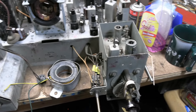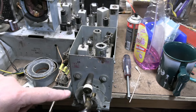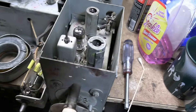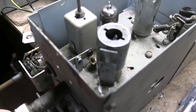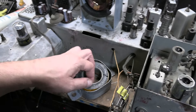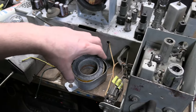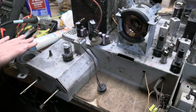Alright, getting to do another power-up test. Finished cleaning the chassis, got all the tubes populated. I replaced the belt with a rubber band — I know some of you didn't think that was the greatest idea, but it works. I baked the coil in the oven at 175°F for 15-20 minutes; it was bone dry before I put on the corona dope. I'm going to put the set on its side, rig up the test CRT, hook this up down below, and if all seems well I'll seal it back up.